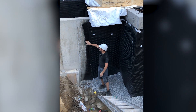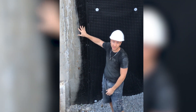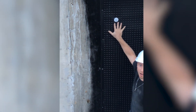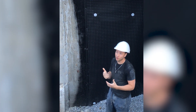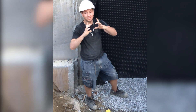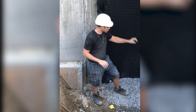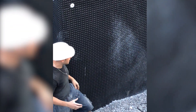Right here is basically the black tar membrane that's essentially spray painted onto the concrete, and it acts as a waterproofing membrane to make sure no water gets through the concrete and into the house. So black membrane goes first, and then on top of that they put the dimple board. The dimple board is essentially almost like a giant Plinko board on the inside, which helps funnel water down to the bottom of the concrete where your weeping tiles sit. Weeping tiles are basically a six-inch tube which sucks up any moisture at the bottom, runs it to your sump pit, which is a pump that shoots all that water away from your house. On top of that you have some stone to help with free drainage for the water to seep through.